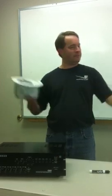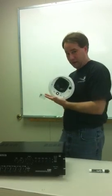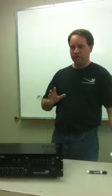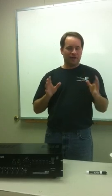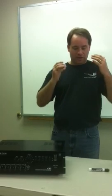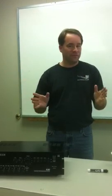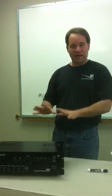This is a question we get all the time. A 70 volt system is for when you want to put in a lot of ceiling speakers or smaller surface-mount speakers — bullhorns, any of those types. With other types of amplifiers you'd need one amplifier for every four or six speakers, but with a 70 volt distributed line system, we don't have to do that. We can use just one amplifier.